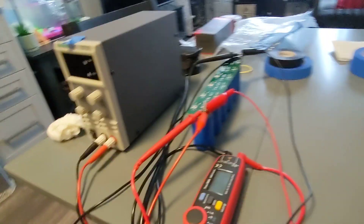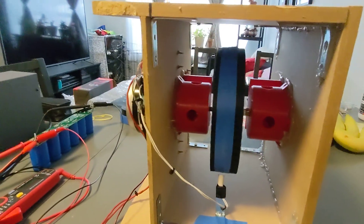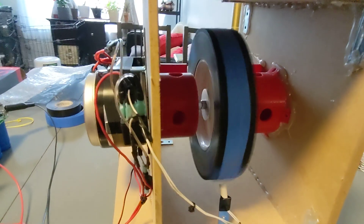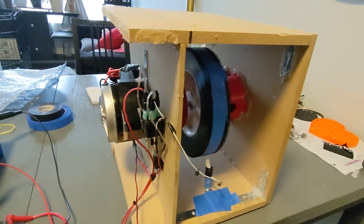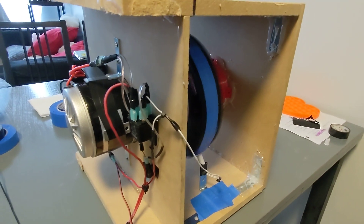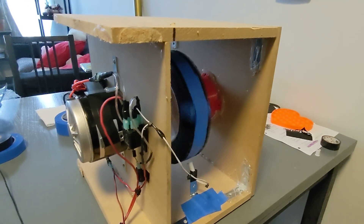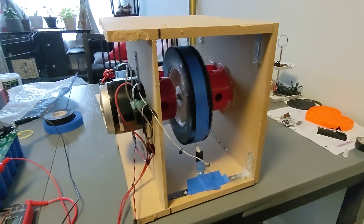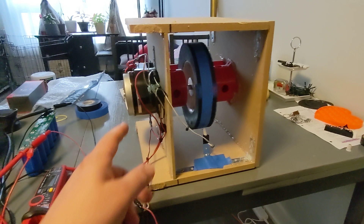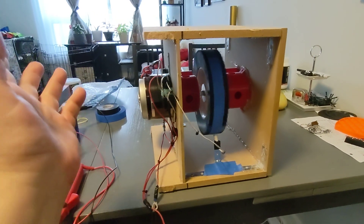It's still going — very cool build. I liked it even though it's obviously not the end product. A lot of improvements still needed, but at least I'm learning something. This is the other part of the system that I can use to actually run something and sustain a couple hundred watts or more. She's still running. This thing could actually run quite a bit longer, but this switch needs a minimum of six and a half volts to operate — as soon as it drops to six and a half volts, the switch just cuts out because it doesn't have the power.